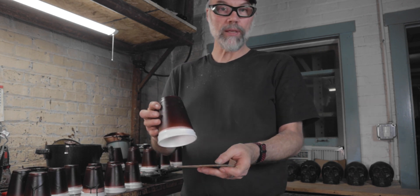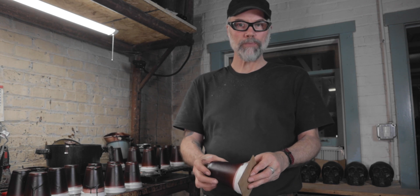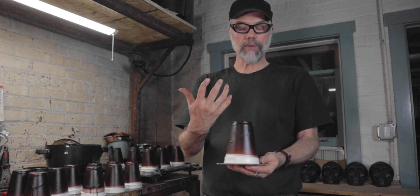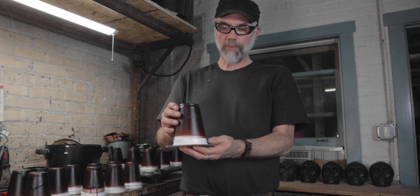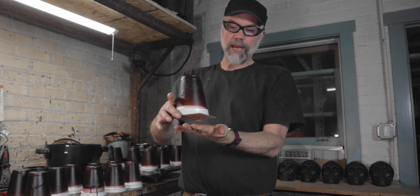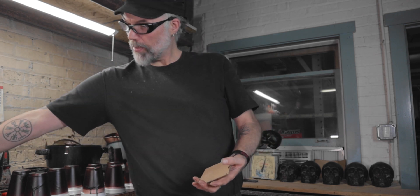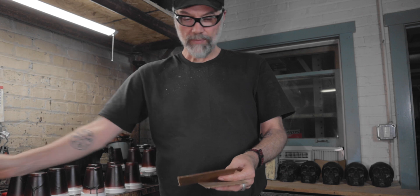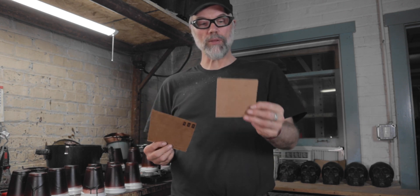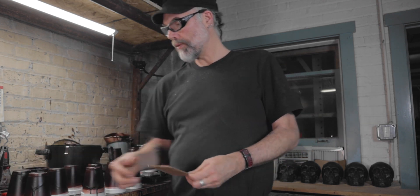The purpose of the cardboard is a couple of things. One, it seals off the cup so that as it's floating around in the ceramic shell slurry, the cup isn't filling up with slurry and we're not casting the inside of the cup. Also, we're going to gate things so that everything balances on top of the cup so it can dry evenly around the sprue system. The cardboard sections give a nice flat surface for things to balance on. I use a couple of different sizes — if a sprue system is larger and needs a bigger footprint, that gives me that ability — though probably 90% of the cardboard I use will be just about the size of the cup.